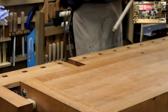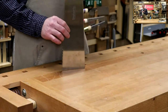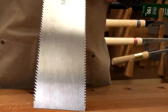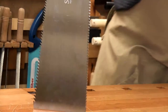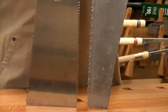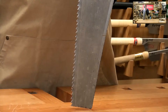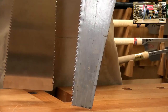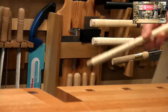All right. So a Japanese handsaw, well, we've got this here and we're up here. Let's just go to three then, Ben. Let's have a look on there. This has got different teeth, but the teeth actually point towards the handle. If I can reach down the other end of the bench, let's just grab the Western saw. The teeth point away. So they're pushing into the workpiece. So that tooth direction is very different before we start, okay? All those things become a benefit on this.